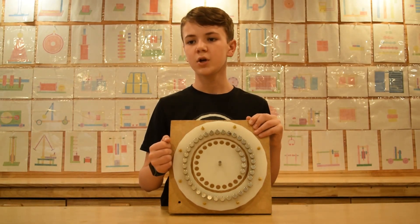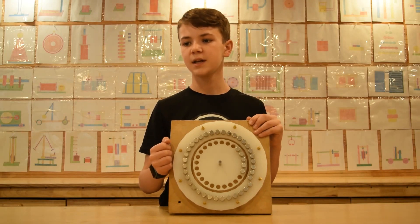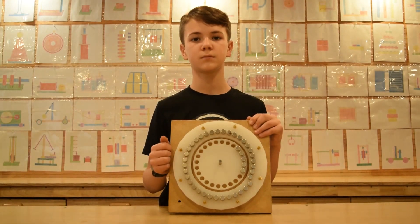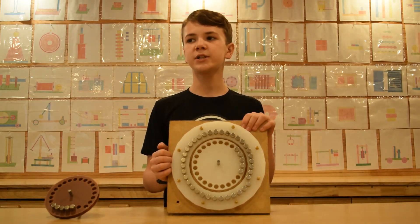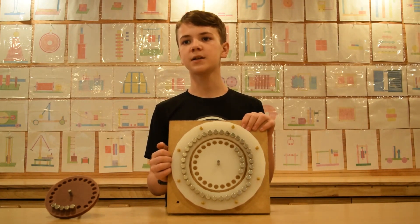In this prototype, we used only half an inch thick Neodymium permanent magnets, and the gap between the rotor and the stator is one fourth of an inch. This motor produces torque to the shaft. The interaction between the rotor and stator pushes the rotor uphill against the force of gravity.